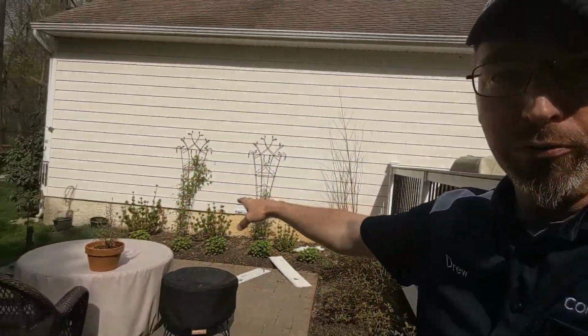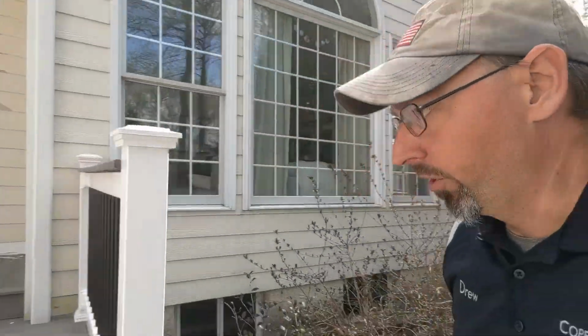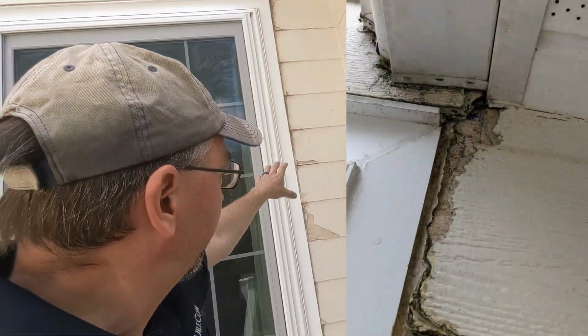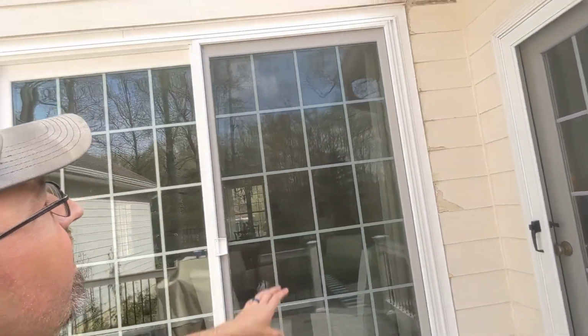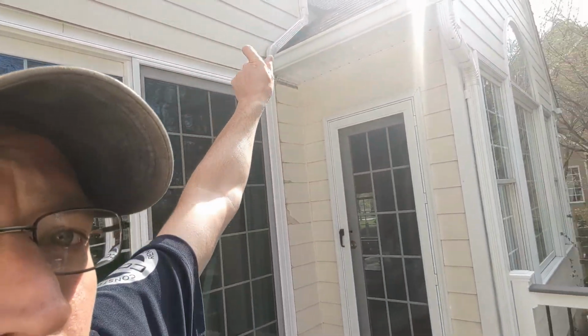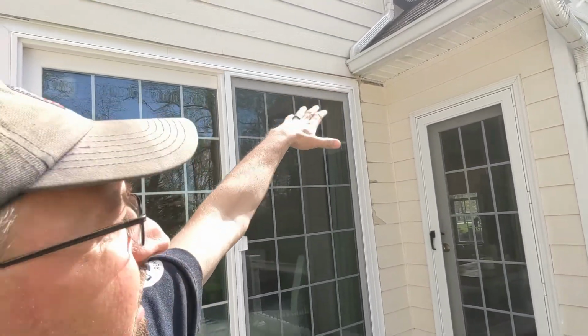So you can see our crew's already removed the bottom board here across the bottom of the deck, and then we're working up inside here as well. We've got some water damage from how this gutter was set up that came down this edge. Several pieces here that are chipped out. So we're going to run a replacing top to bottom through here, and then a couple boards over top, because again, we want to have that 2-inch separation up along that roof line. So that downspout's going to come off. We're going to put the proper flashing in there and then rerun probably about 4 courses of board.